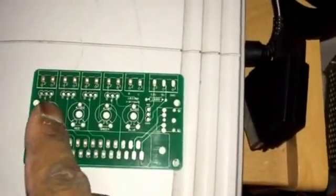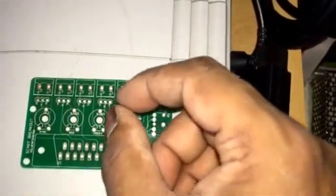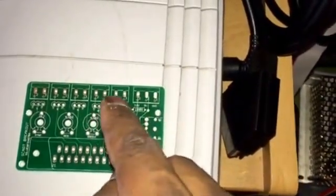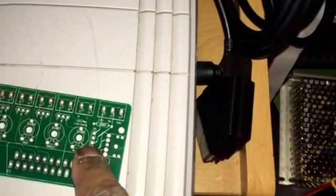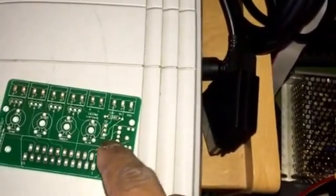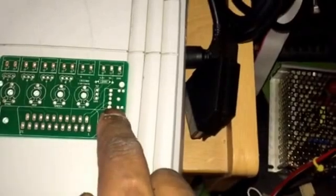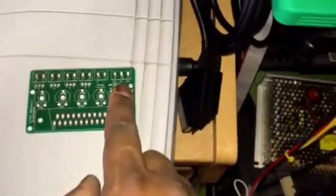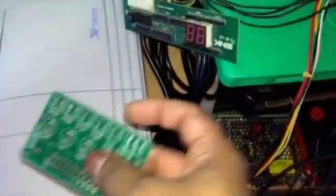Same with the sync — you can set your sync. You've got three headers there, those are jumper headers. If you set it one way, it goes through the pot; the other way, it goes directly to the pin, bypassing the pots with your 180-ohm resistor. You've also got a jumper for 16:9 and 4:3 which goes to your standard pin for RGB switching. And you've got a headphone jack — that's if you don't want audio coming out of your SCART.